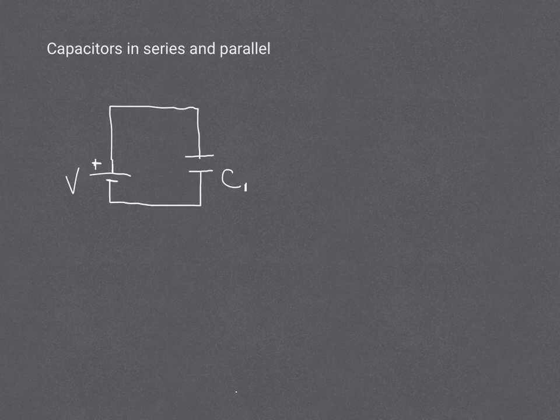This capacitor is going to have a voltage across it that is equal to what the battery is. So if I call this V battery, this is going to have that same voltage across it. Because the battery is acting like a pump — it's able to push charge through the wire and to this plate, and it's going to fill up on that plate based upon its capacity. The negatives are going to be pulled towards those positive charges and end up static as well. So this is still a static situation.